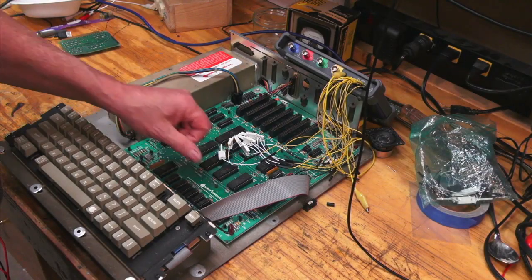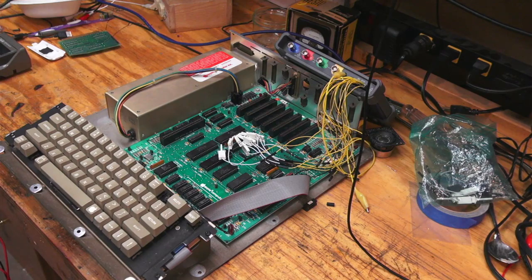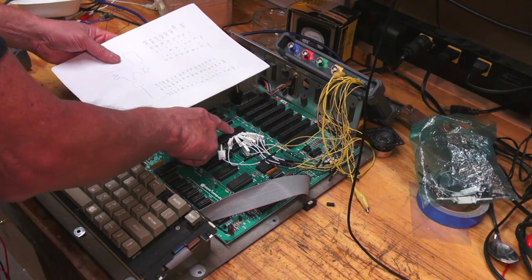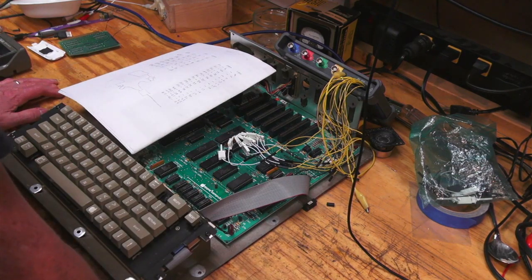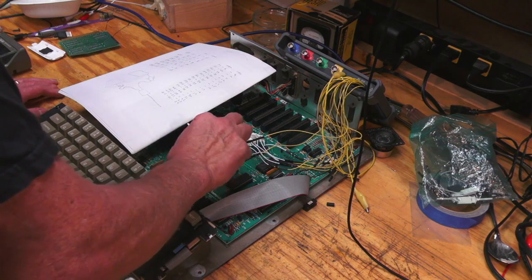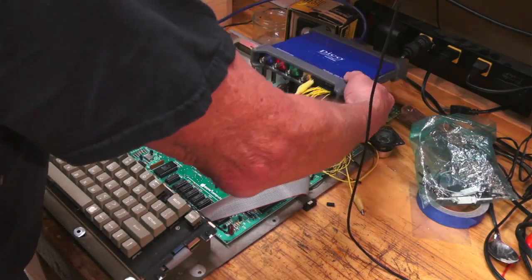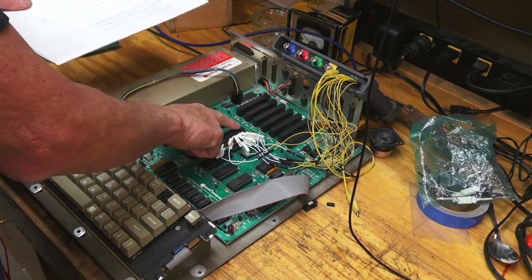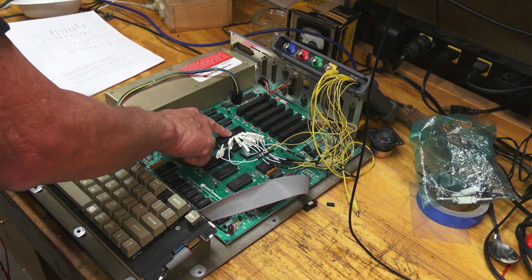I wasn't seeing what was messing up that line there, but I thought I'd take a different approach. On the memory controller, I thought I'd look at the address lines. I'm hooking right to the address lines of the CPU, and I thought I'd just see what is coming out of there. I've got this picoscope here that I borrowed from work, and I've got these hooked up, plus the data lines.